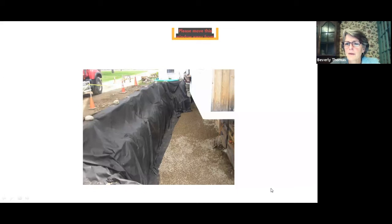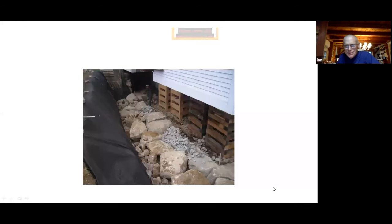Here you can see the stone starting to go in. You can see how wide the dry laid foundation is at the base. We put a lot of stones behind it with connector stones going across. There should be no holes in a new dry laid stone foundation — they all get filled, but you don't just drop stones in; they have to be touching each other so there's no movement going down the road. You don't use round stone for filling — you want stone with jagged edges. All those stones get placed so they're each touching on the bottom, filling in all the little spaces as you go up, and the stone batters up from outside to end.